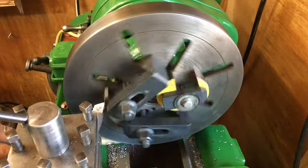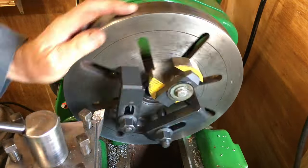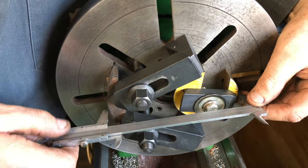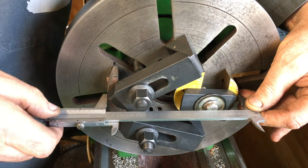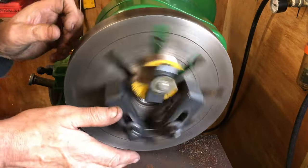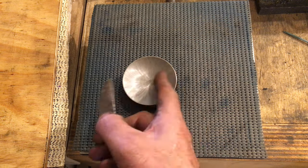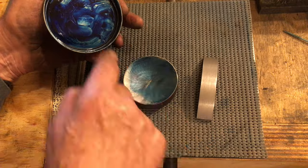Because of the backlash in the back gears, the intermittent nature of this type of cut leads to a great deal of clatter while the cut is in progress. Just out of camera shot I applied a small amount of braking force to the chuck's outside circumference using a bit of wood. This drag was enough to let me hear the cut and, more to the point, when the sound of the cut changes signifying the end of the tool run. With that done I could offer the partly machined tool support into the puck — the radius was perfect.